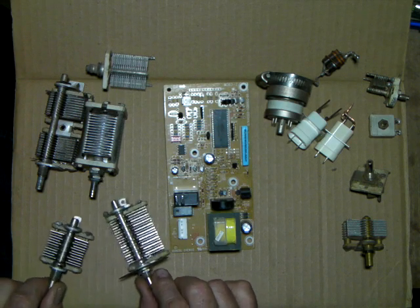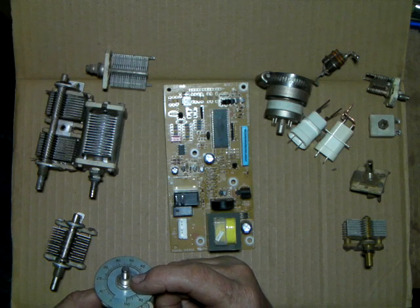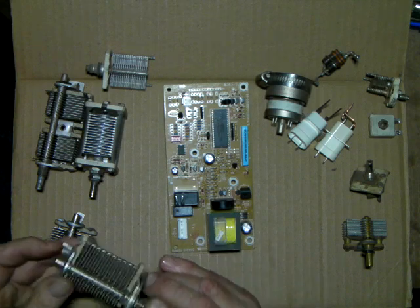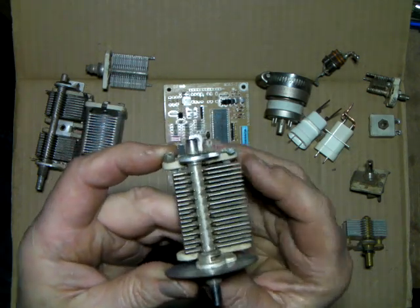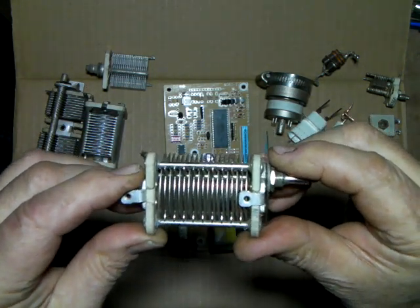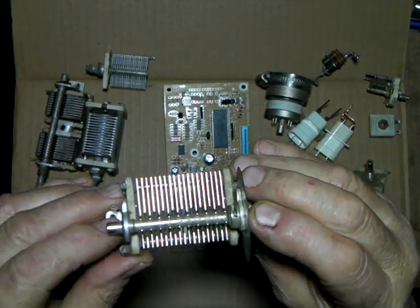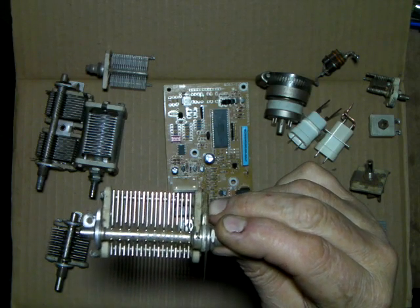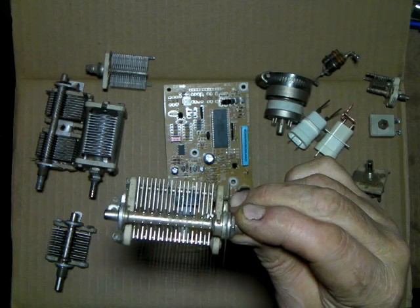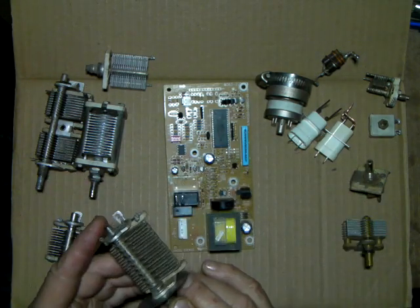Plate cap should look like this. I like to get the ones with the ring connector on the end because it's got a little ferrule and a threaded shaft, and then there's a little ring nut that holds it. So all it takes is just one hole in the front panel and the ring nut tightens down and holds that in place. This one's a 50 picofarad. The plate spacing should be around a sixteenth of an inch roughly to hold off the high voltage. If you see any of them that show a measurement, it should be around 2 kV to maybe 2.5, maybe almost 3 kV would be even better — around 2.8 kV to 3 would be about right. That's a 50 picofarad cap.